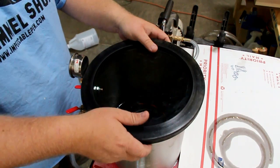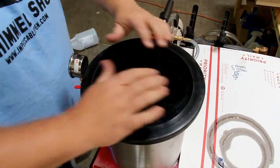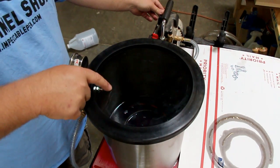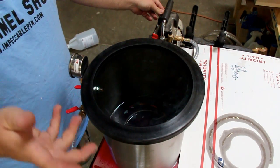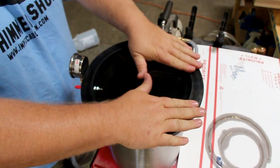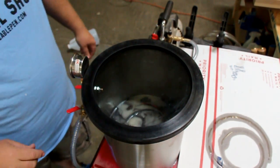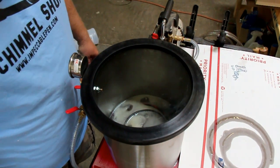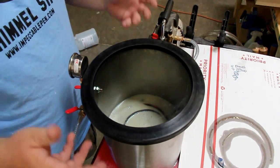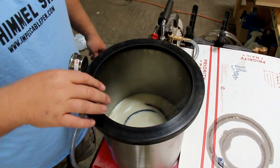I'm going to go ahead and put this on here, make sure it's in the right spot, and then fire up the pump. What you'll see is all that air start to come out. It'll take a few seconds to get a nice vacuum going. You can already see the air coming through there, and on certain woods it'll just boil with air coming out — just keep coming and coming. You'll see a lot of little bubbles, and big bubbles where just big bursts are coming out.